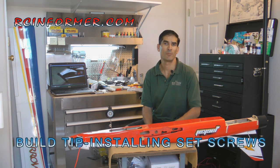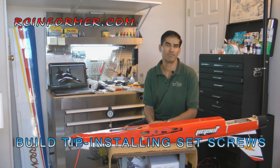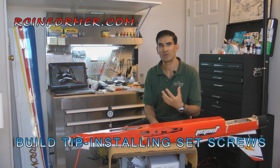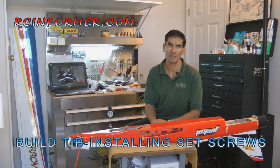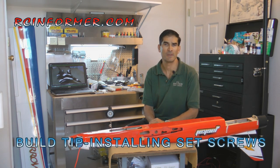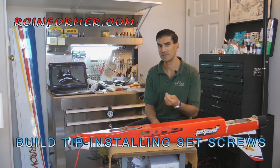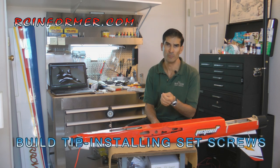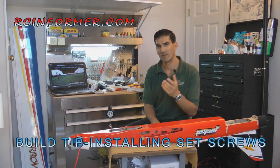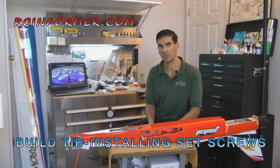I hope you enjoyed that video and find it useful for a lot of your airplanes, making your stuff more reliable and safer. When installing set screws, always use a flat spot and consider the type of metal the shaft is made out of — some are harder and some are softer. The softer ones tend to get a better bite when you put your set screw in, and that actually helps a lot. Use thread lock. About the only time you might not want to use thread lock is with an aluminum wheel collar with very fine threads — thread lock on fine aluminum threads can actually destroy the thread. Aluminum provides a good natural bite on the metal and stays in there without needing thread lock.